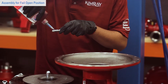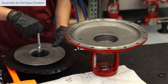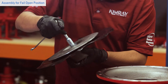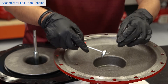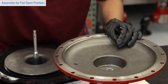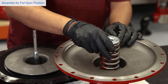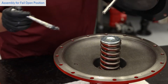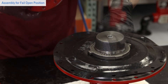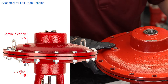If you're assembling the control valve for fail open operation, apply Loctite to the threads and insert the upper stem into the other side of the pivot sleeve. Use a 3/8-inch wrench to hold the stem. Install the pivot on the lower adjustment screw with the bevel side facing up. Add grease, then install the lower spring plate, spring, and upper spring plate. Grease the upper spring plate and the upper stem to prevent damaging the o-ring in the lower adjustment screw, then install the assembly. Replace the bonnet, aligning the diaphragm holes with the bolt holes. Also align the breather plug with the communication hole.